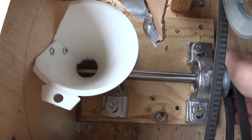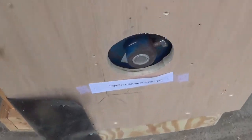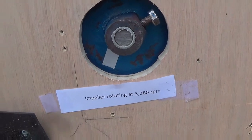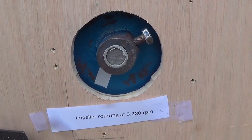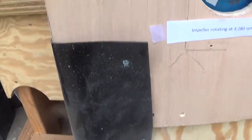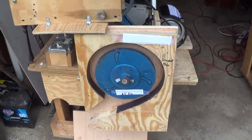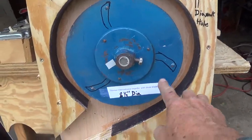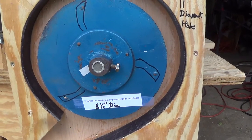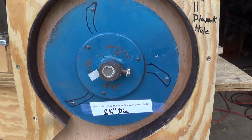Here's the shaft here. Over here, this is our impeller. This little button right there is so that I can use my optical system to figure out the speed — it's a tachometer that reads that. This is just a deflector — this black down here. Now we're going to take it apart. I've now removed this outer cover. This is our impeller — that blue. It's eight and a half inches in diameter and it has three blades on it. We believe they use three instead of four because they're going to do sunflower seeds, but we're not sure.